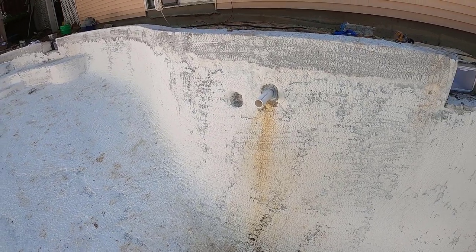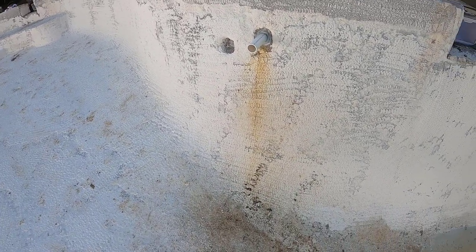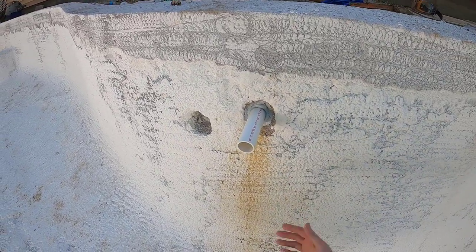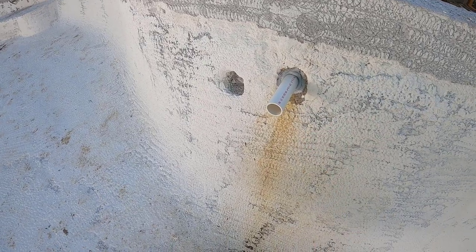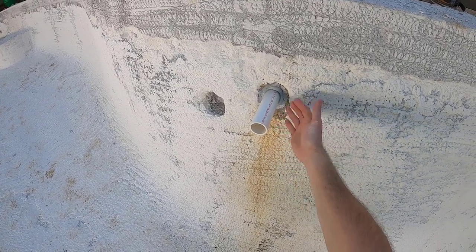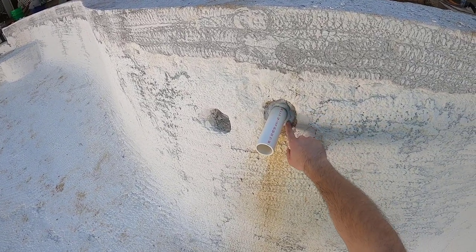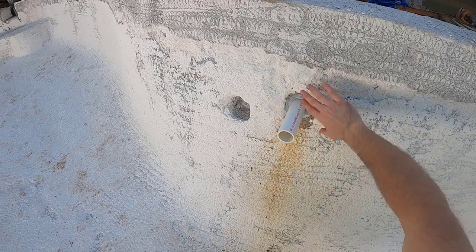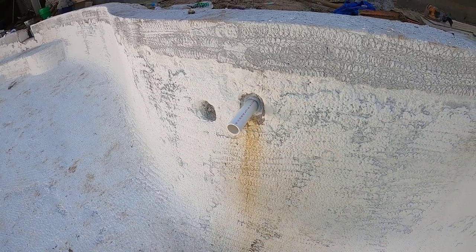I've also got another video where we're gonna film the finished job on the return pipes through the walls here. After the plasterers came and did their demo work, it exposed the previous fittings that were there — and it was a hack job we uncovered on the three returns in the pool. I was able to remove the old pipes because they had been core drilled and installed in a previous renovation, backfilled with expanding foam. We've run new pipes stubbed out past the pool wall, and I pumped a full tube of that same urethane in and around each pipe and let that set overnight. The next step is to pack in some of that same hydraulic cement for a little more stability and waterproofing before the plasterers come later this week.